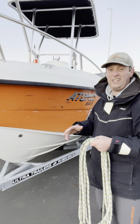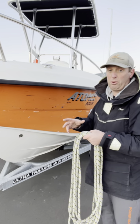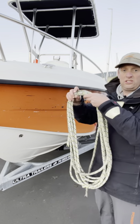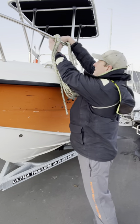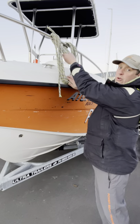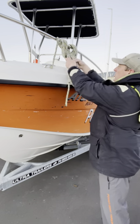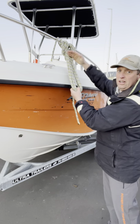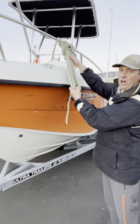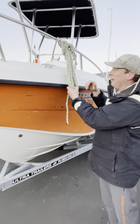So if you're launching your boat and you need to just quickly attach your coiled rope somewhere for rapid deployment use, we just take the coils, find a rail like this somewhere on your boat, pass it over the rail and pull the coil through its own coils like this. Pull it through, get it nice and snugged up. Now you do want a length on this part here so that it doesn't undo and fall off, because falling off from here would be quite bad if you fell in the water and you got this rope on your propeller.